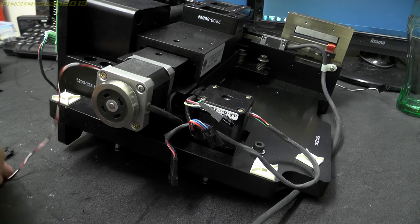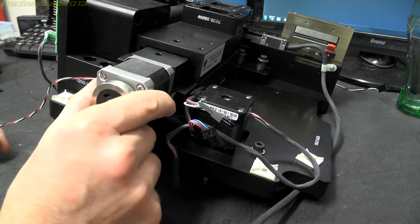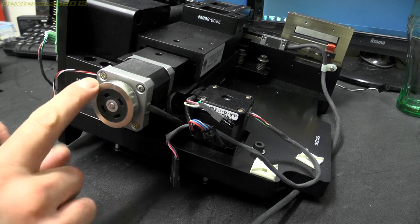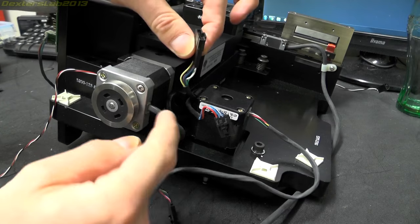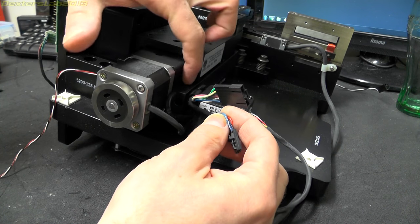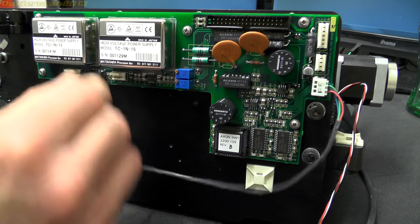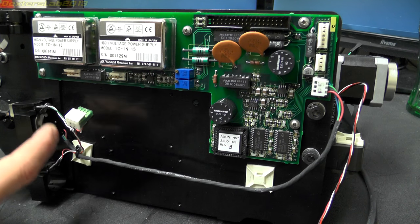If we just have a quick look around the back of the main unit: there's a connector here which seems to go to some kind of sensor buried away down in here. You can see the back of the stepper motor — this has a little rubber wheel on it, like a harmonic dampener, you often see that on the crank of a car engine. Got the connector for this stepper motor. I think I'll just take off this PCB here — it's got a couple of connectors for those two optical sensors I pointed out earlier. And this runs to this motor here which just turns that attenuation wheel for the green laser.